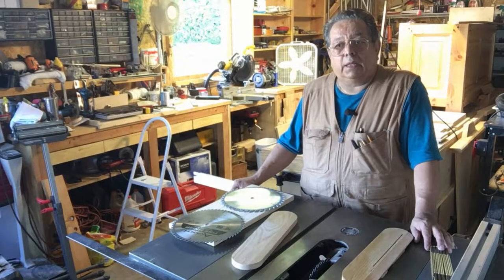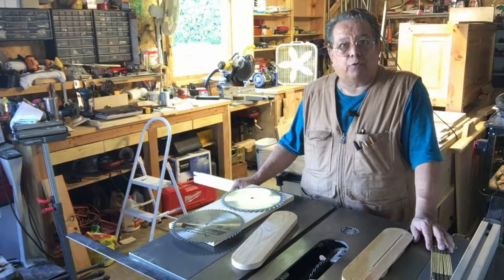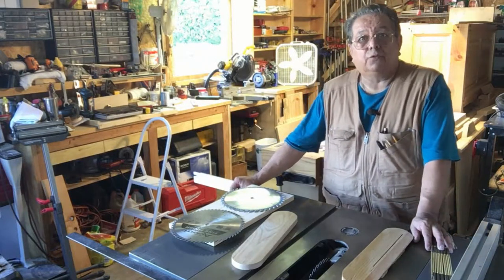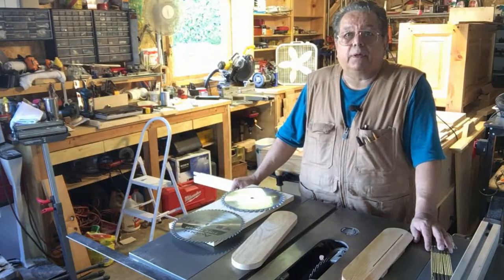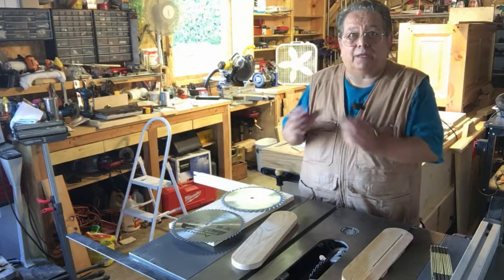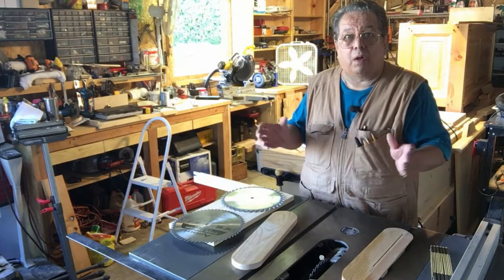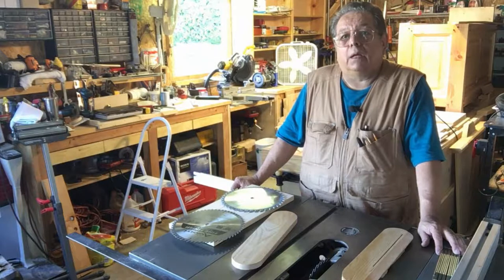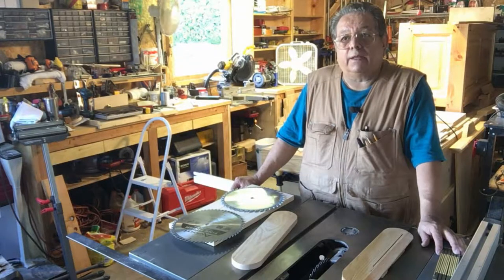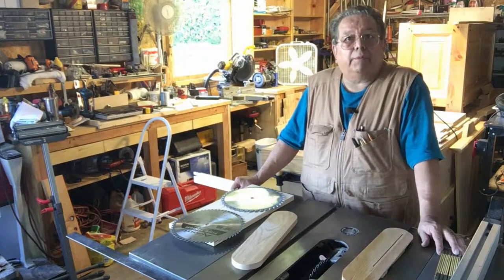But he is so sharp in terms of telling you that your little guide piece should be about 4 thousandths smaller than the actual opening, so the ease of getting in and out makes a lot of sense. And plywood cuts different than hardwood. Plywood is like a sponge. Your cut's not going to be the same as when you cut a piece of oak or walnut or cherry or pine. They're all a little bit different. The other thing is cutting the tails a little narrower. It makes so much sense.